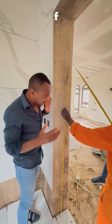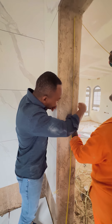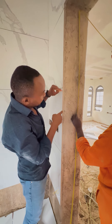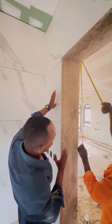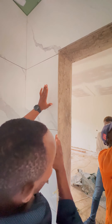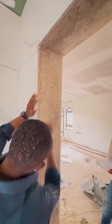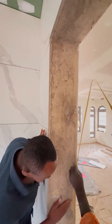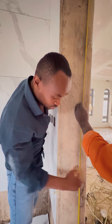For the places you do tiles, you have to tile first, then take measurements from the tiled and skimmed side all the way across. You will realize that during finishing works, because the plaster is sometimes not straight and you're looking for your square, some spaces will be slightly thicker and some will be thinner. At the end of it, we are looking for measurements that will fit from this side to this side.